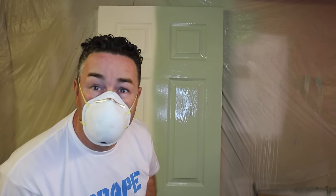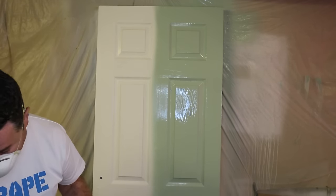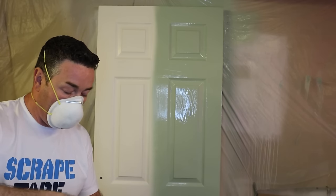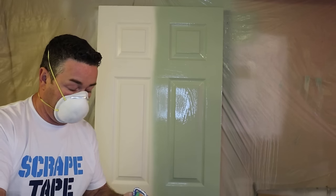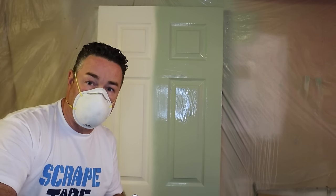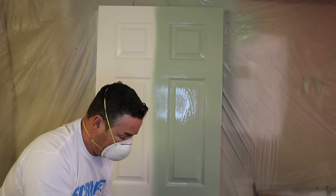Do you know what? That is lovely. I really like that. That's dead easy to spray. I'm just swapping my tip over because I might find I need to drop my pressure down. So we're now on a 308. I'm dropping my pressure down to 3.